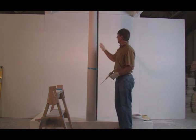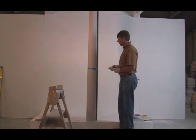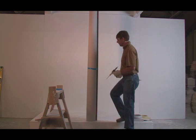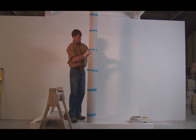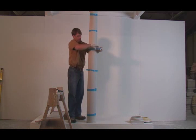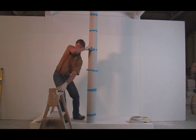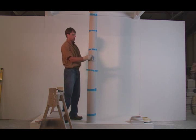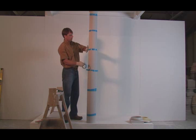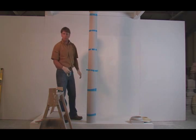As far as gluing is concerned, we've removed the column so that it's offset, exposing the edges we want to apply the glue to, making it easy to access both sides. I'm applying pressure with the tape — you can pull it as tight as you need, it's very strong. What you don't want to do is use clamps and squeeze the column so tight that you starve the joint. If you look closely, you can see we're getting a nice little squeeze-out along the edge, and you can flatten that out if any areas appear to be dry.